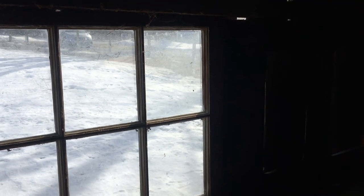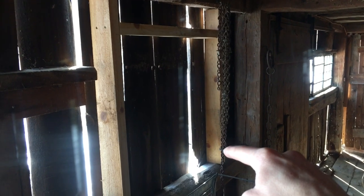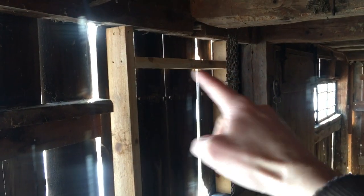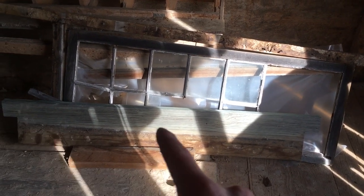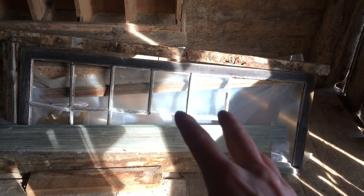So they come out pretty easy, and this is also odd — the top frame member there actually just ends and the only thing holding that is the siding itself. So these are not substantial at all. You can see I have framed in a new window opening there already and the two-byes are going from the beam right down to the girt, and then the header is screwed through from the two-by there. I pulled this window out yesterday — that was the sill, which is a piece of treated lumber so that was replaced at some point — but again there's that sash, and most of this one the muntins are totally rotted out, there's only a few panes of glass even left in this and it was pretty broken up.